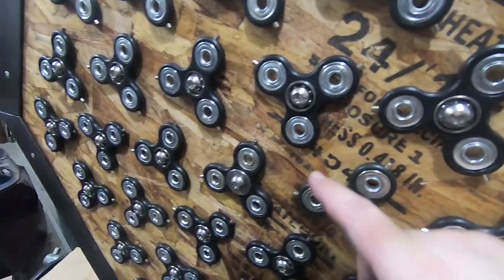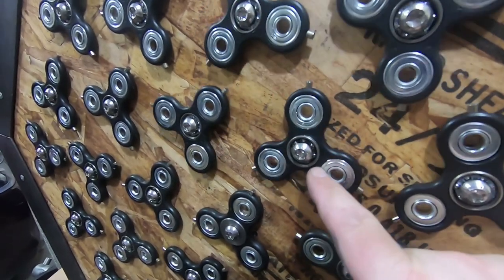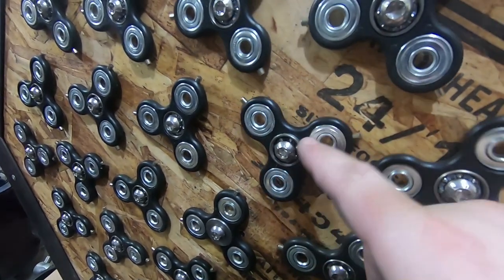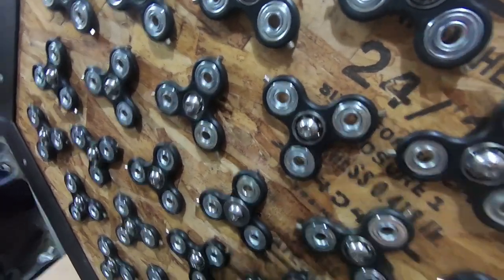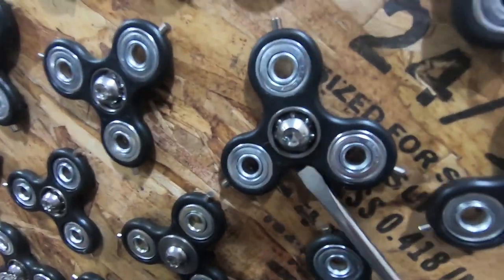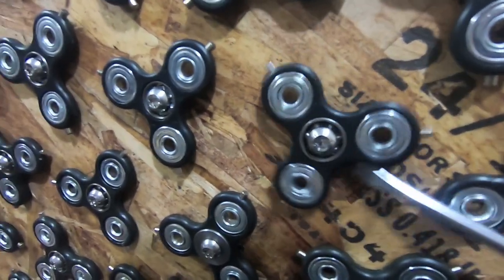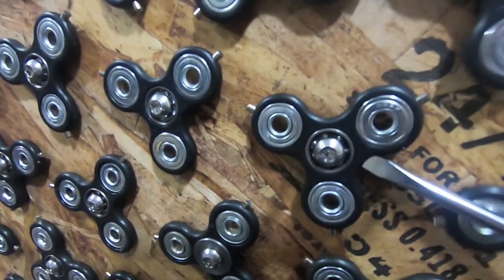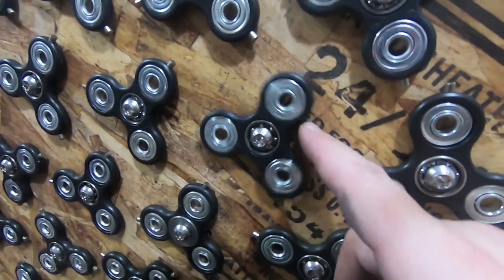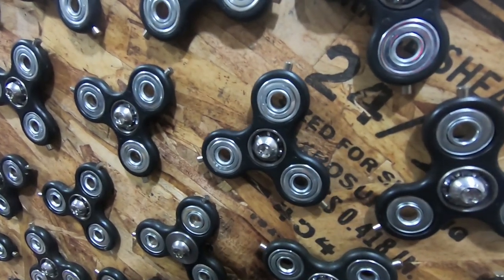Now that I can inspect it up close, I realize this isn't missing the washer behind it, like I thought. The bearing has just slipped out a bit, because again, it's just a press fit in there. So I can work that out with a screwdriver, and it'll be just fine again. Which is good, because screwing these back in again against the stop nuts is a real pain, and also it means I wasn't silly enough to forget a washer back there, so yay.